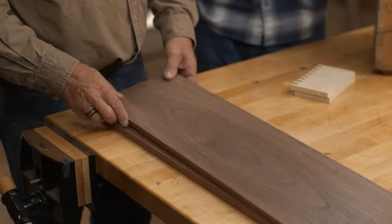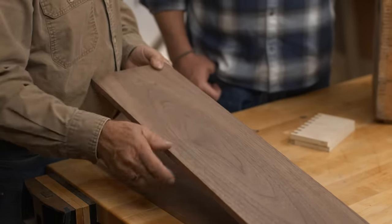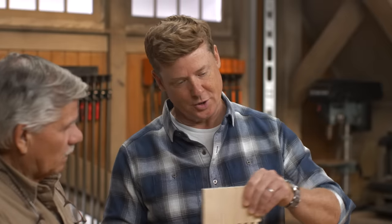So this is your material? This is the material right here. We're gonna use half-inch walnut. We'll make the tray out of that. And how do you want to make the actual joint itself? Because I guess you could do it a couple different ways. If you wanted to, you could hand cut it, but that would be ridiculous because you'd be there for a day making one corner. The easiest thing is to make a sled so you have a jig and a dado blade, so you can just zip it through — make cut, cut, cut, one after the other.